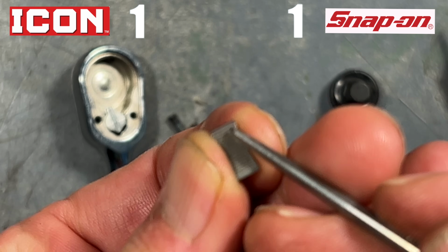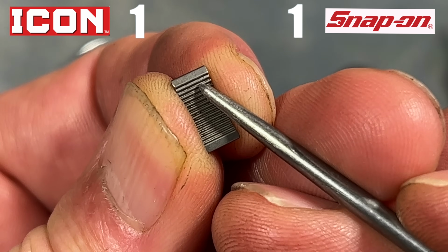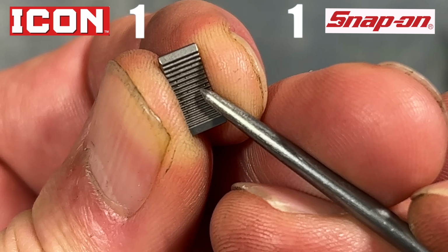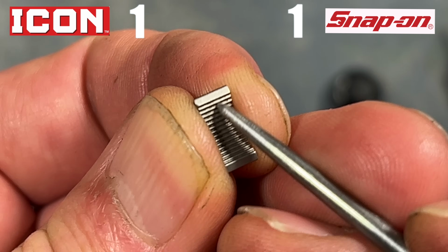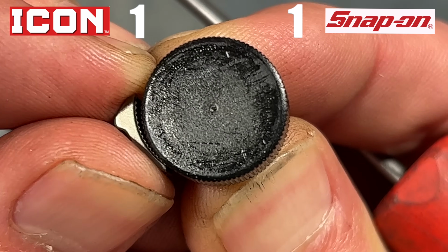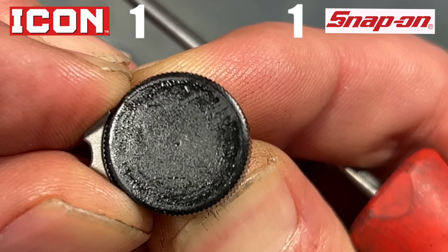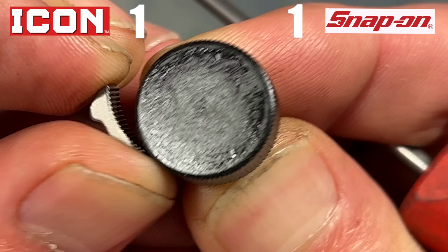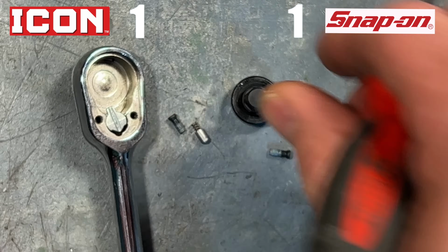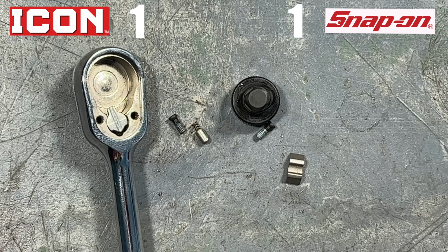Let's go ahead and count the teeth here that could possibly be contacting. That'd be 1, 2, 3, 4, 5, 6, 7. I'm just going to say 7 here. These 7 teeth here are going to be able to contact on one side of the anvil, just like that. And then when it swings over the other direction, another 7 teeth are going to contact it on the other side. So that's not bad. The EP Auto, I think, had about 3 teeth in contact with the anvil, and in my opinion, that was a pretty weak design.